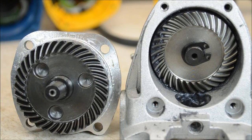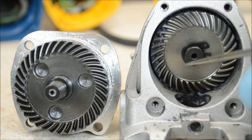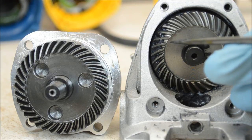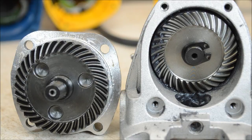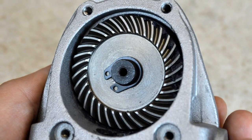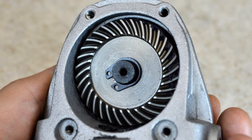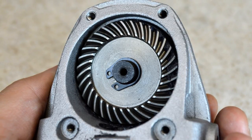Taking a look at the gears, one thing is clear right off the bat — these are both fully machined gears, cut from a piece of stock, and the machine work on both is very nicely done. There are clean, consistent, and fine machine marks on the top of the DeWalt gear that continue into the nicely cut teeth. It's a similar story on the Harbor Freight — quite good work, maybe not quite as fine and consistent on the turned surface, but still very good. Both of these are loads better than the quality seen on cheap grinders. Note: there's no keyway on the DeWalt gear — it's pressed together, so I left it as-is after removing the snap ring.